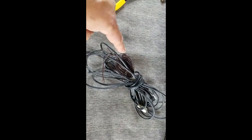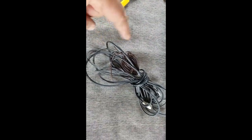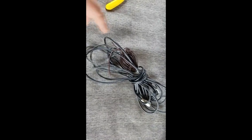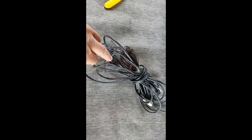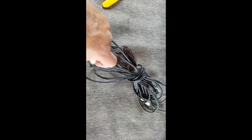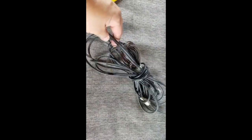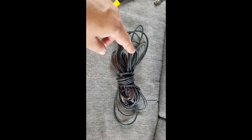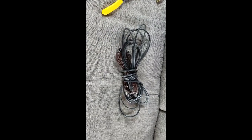The antenna is just a little long — probably half an inch too long — so I'm going to take a half inch out of it to lower my SWRs on 27385. It's a bit too long, giving me flat SWRs from about channel 5 down to a few channels below one. I want to shorten it and move that sweet spot up a little higher. I'll take off about a half inch on each end.